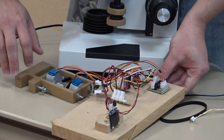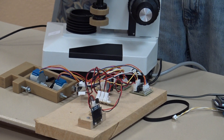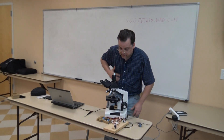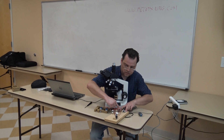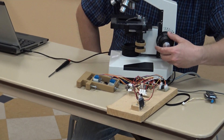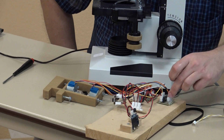A microcontroller like an Arduino or a Raspberry Pi can't power larger things like motors — they can do flashy lights and things like that, but they can't drive motors. So these two are the motor drivers: one for X, one for Y. If I eventually add focusing I would have another motor and another motor driver.